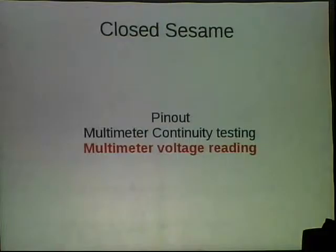After you've done that, the next thing you really have to do is voltage test everything. This board runs at 3.3 volts, but the battery supply is actually 6 volts because it's four AAs. So one of the things you have to check is that each of these pins is actually 3.3 volt tolerant, because you don't want to cook the equipment you're using to test it. It's helpful to get an idea of what each pin is doing by measuring the voltage on it at any given point. That's how we found the battery pins. The battery pins were high at 6 volts, but everything else was either floating, at ground, or high at 3 volts. So that's a good step to take. I burnt a lot of equipment not doing that. Connecting something that's only 1.8 volt tolerant to a 9 volt pin, you get some blue smoke pretty quickly.